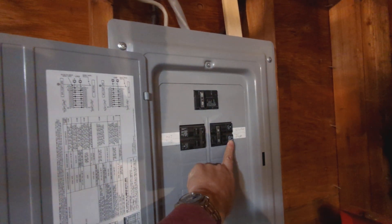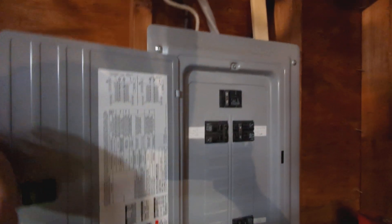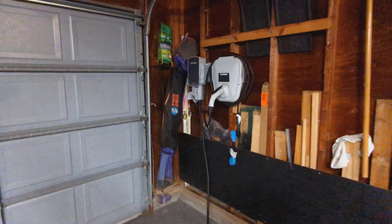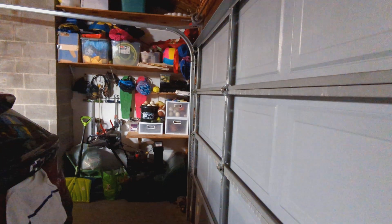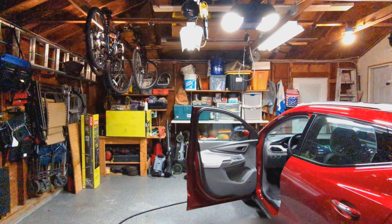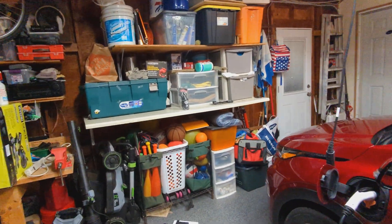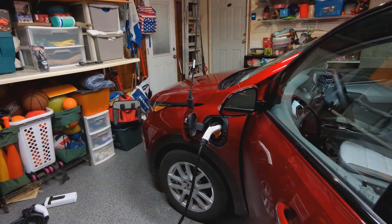You're probably asking why I'm using this subpanel. Well, this subpanel is a 100-amp subpanel and it currently has the JuiceBox on it with a 50-amp double-pole breaker. There's also a hot tub on the back of this garage on another double-pole 50, so adding another heavy load onto this box is not really possible — hence the new panel. If you only have one charger, the most common places to mount them are in the left or right front of the garage. Other people put it dead center on the back wall so you can reach both cars. I like overhead mounts because it's kind of like a gas pump — it's right there where I need it and keeps everything neat and off the floor.